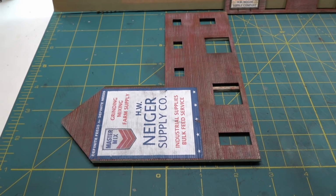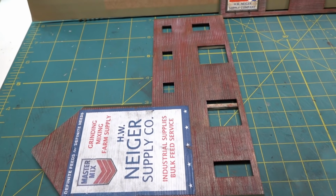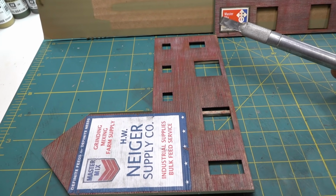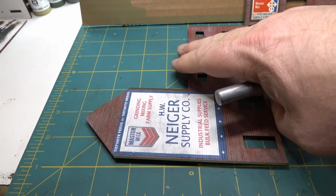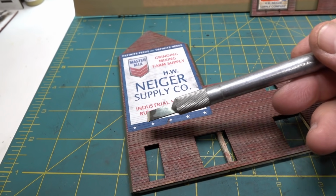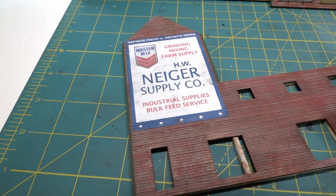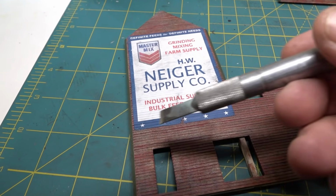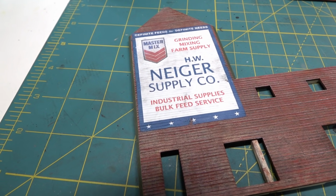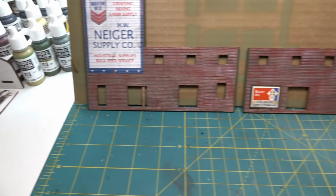semi-dull blade, which they recommend, I think a number 17 blade, whatever this one is here. This is an old one that I had laying around. And then, once it's set up for a little bit, I very carefully went across every clapboard, and you can see it. I wear magnifiers, but you'll get in there, you'll see it. You'll come right across the clapboards, and it snuggles it in there pretty nice. So that's how I did the back one.